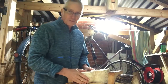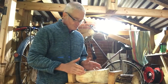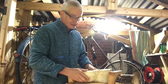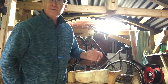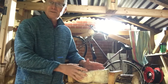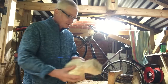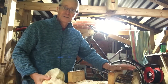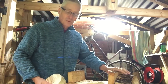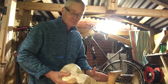So, as you can see, what we've done now is we've changed to a different type of raised chopping block. This type of chopping block has two ends to it essentially, so we can very firmly wedge the Kuksa bowl into it while we're doing our gouge work. To make Kuksas, you really need to have the raised chopping block that we had before, and also this chopping block. So you'd have to make both chopping blocks.